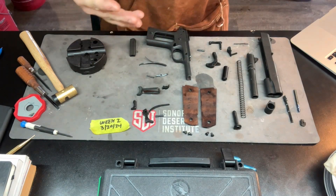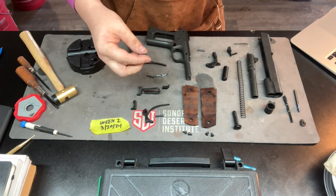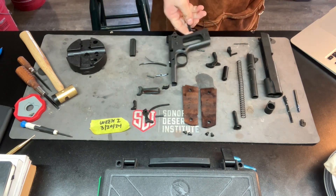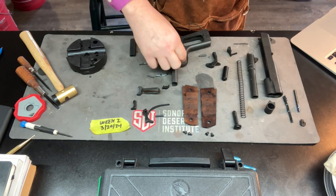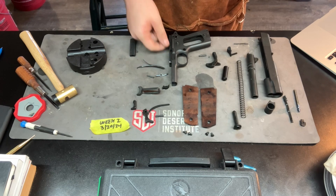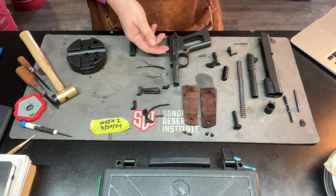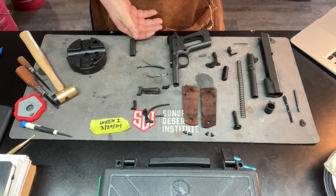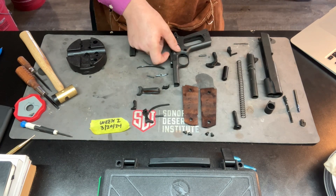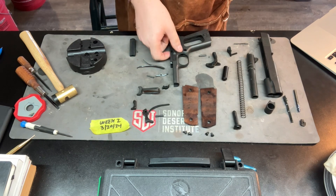For the fourth piece, it is number 41, which is the slide stop. As I was mentioning earlier with the plunger spring, this sits in the frame right here and it keeps the slide — it'll lock the slide back in place. When you rack the slide, it keeps it from going back too far. It allows you to lock it open if you need to clear your weapon, and when you fire your last round it locks open, like most modern semi-automatics. That's important for safety and for the feeding and chambering portions of the cycle of operations.